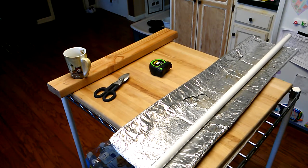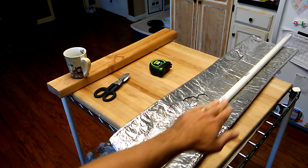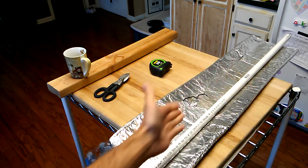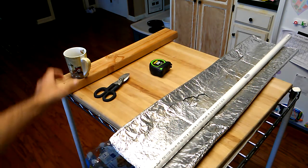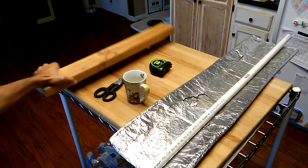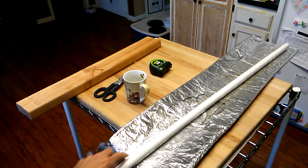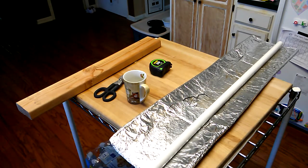I'm just going to flatten taper the tips. I'm not even going to show you the way that I flatten all of this, because you've seen that a million times: how to basically heat it up and flatten the ends. In this case, I'm making the handle 2.5 inches on each side of true center. So that's where we are, and I'm going to flatten it, and the next time you'll see this, it will be flat, ready to go, and I'll get right onto the tips.